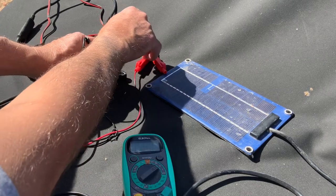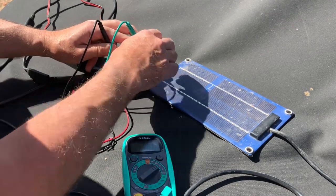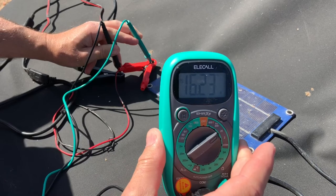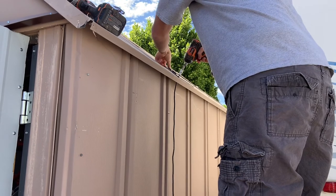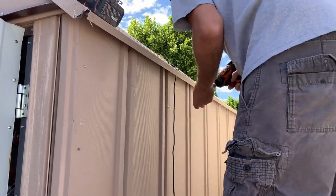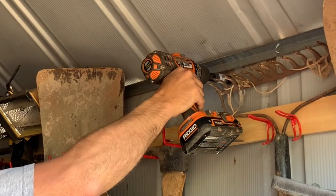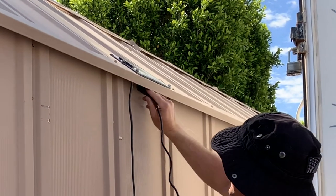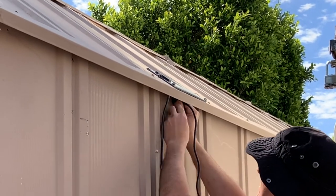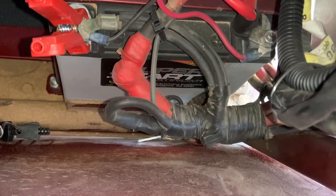This was an old solar panel I had laying around for years, so I decided to check and make sure it was still producing voltage before taking the time to mount it. I put my multimeter on the alligator clips, positive and negative, and checked the voltage — I was getting 16.23 volts, so it is working. I'm anchoring that solar panel to the roof of my shed by drilling a couple holes and running some tech screws through. Once I got it anchored, I went inside and drilled a hole through the side of the shed to run the wiring in, then put a rubber grommet to keep that hole sealed up.